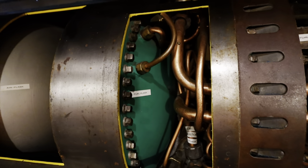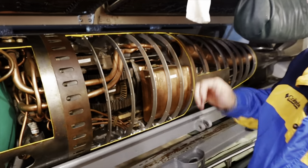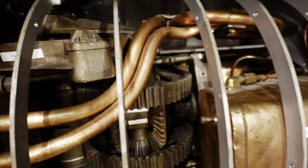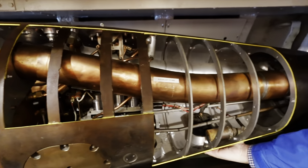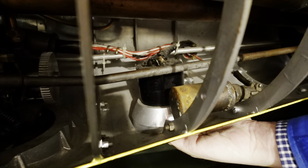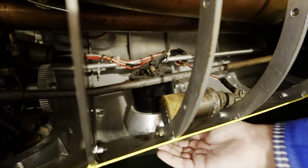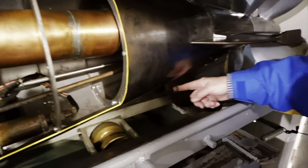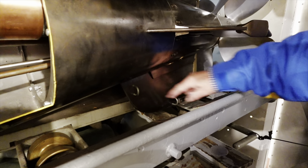If you've watched earlier episodes, we talked about how to start a torpedo — here's the starting switch. Things here are pretty much labeled thanks to Al Winkler. Here's the turbine, here's the lube oil tank. And this is the inside of the Mod 5 electronic pin assembly right here — this black cylinder with the wiring cable harness coming out of it. This is what supplants the actual mechanical spindles used in World War II torpedoes. It also has a two-pin cable guide, and apparently there's a modification here — our outboard torpedo on Big Henry only has this cable guide, while this one has one up here as well.